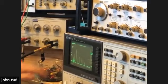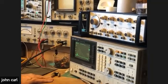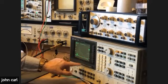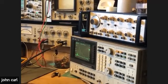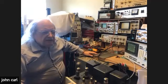So now, the one that we like to worry about the most, and tubes are really good about this, is the seventh harmonic. Now, this is 5, 6, 7. That is actually a little bit worrisome. Not much, but it is a little worrisome because the seventh harmonic is literally not related to any musical scale that we could normally adjust to, at least in Western civilization. So we're sort of stuck. If you have any of that seventh harmonic, it's always going to sound strange.